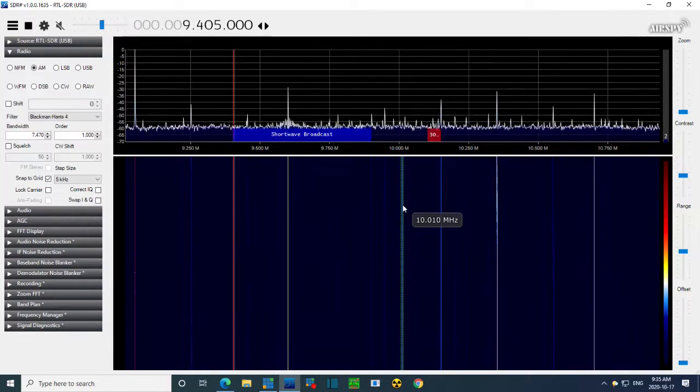So what I'm going to do is tune the radio slightly. This will cause the local oscillator frequency to vary. It should show up on the screen as a moving frequency, but I have the feeling a lot of these lines are going to move. Here we go. Okay, so I'm tuning. So now there is something right in the zone where we expect the local oscillator to be.